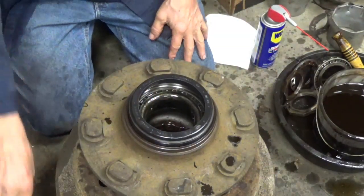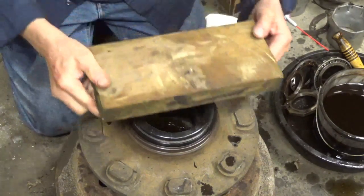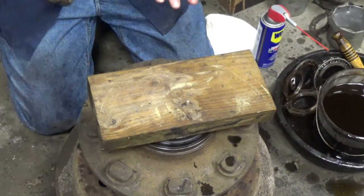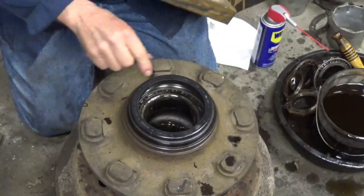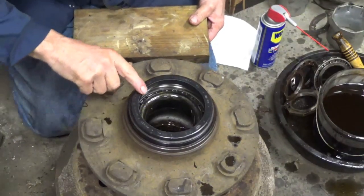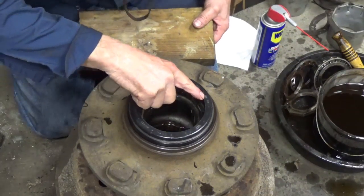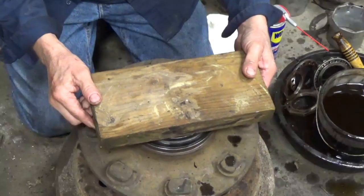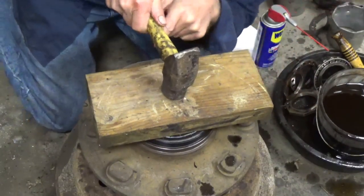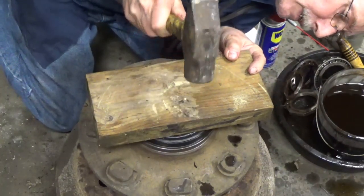Now, this is my steel seal installer. It's a block of wood. On my way just starting in there, I gotta be careful that one side doesn't go down more than the other. Okay, this here actually says air side right here. It's written in there, air side. That means the outside. So I'm just gonna kind of watch underneath here. Okay, this side went down, but it didn't go down too far, so I still can.